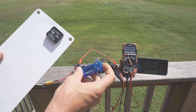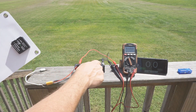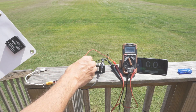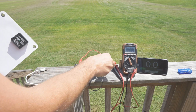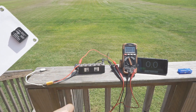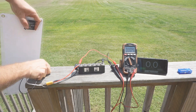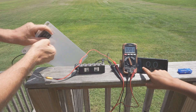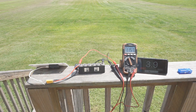In the past I've tried USB current meters to read the current output of a USB device. The problem is these solar chargers have pulsed DC and it really messes with that — it's not an accurate way to measure them. So what I've come up with is charging a boost pack. I charge the boost pack to five volts and time how long it takes, which makes a great baseline for comparison between panels. We'll start a test here with the Solon 110 and see how long it takes to charge it to five volts.